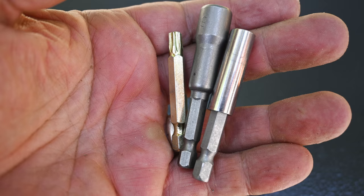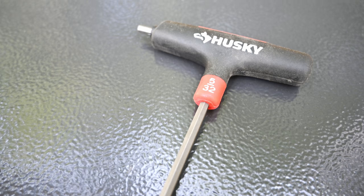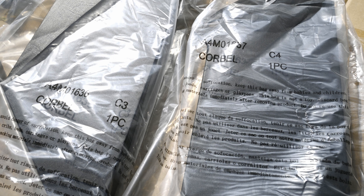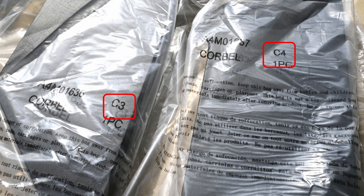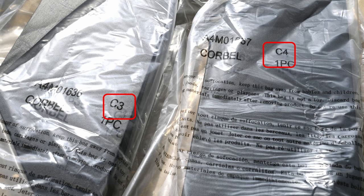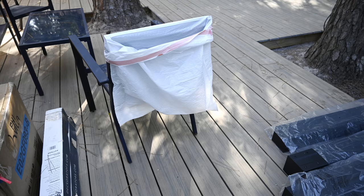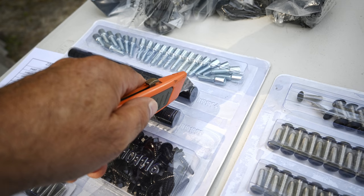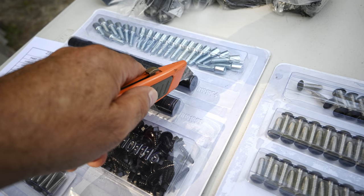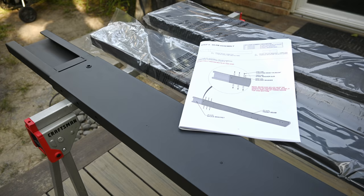The gazebo kit includes the screw bits you'll need and even an angle adapter for tight spots. You should also have a set of T-handled Allen or hex wrenches to hand-tighten the screws and avoid stripping them with your impact wrench or screw gun. As you sort the parts, leave them in their plastic wrapping, since the numbering for each part is on that plastic and some components look similar. Every step in the assembly instructions includes part numbers — lose those number references and you'll be lost. I set up a plastic bag as a waste bag on a chair back, because there are so many plastic bags to deal with. You should also take care to cut open the screw packages so you can leave the fasteners inside with the part numbers showing; otherwise you'll be fishing through hundreds of screws and pins of various sizes. Anytime you invest in organizing before you start building will pay handsome dividends as the day goes on.